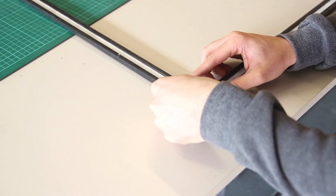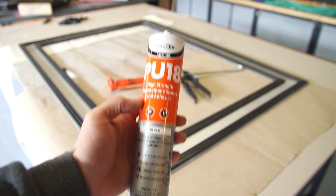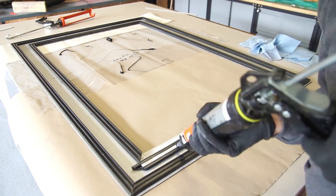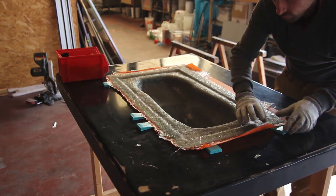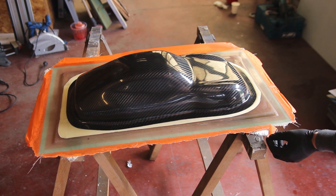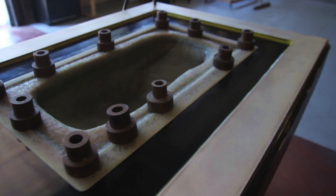For RTM molding you need an outer chamber with vacuum — creating the suction that holds the RTM mold down — and then an inner chamber creating vacuum on the fibers you'll infuse. For the outer chamber I'm using PU18 and rubber strips I bought online. I'm still looking for a better seal — this is the first time I'm doing this and it wasn't rehearsed in advance, so some fine-tuning may happen in the future. As I gain experience I'll improve everything and update you on this channel — make sure to subscribe if you want to see that.